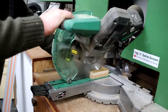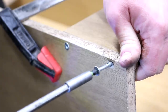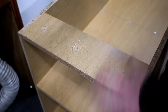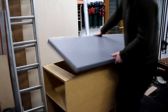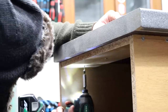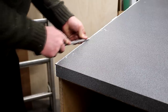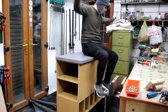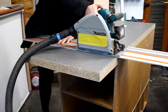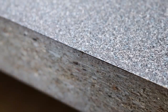The final panels were cut from some off cuts and added right at the top purely for fastening the worktop down to the unit, so I'm drilling some pilot holes. This piece of worktop I found recently in a skip and it was almost the perfect length — I just needed to scrape away some old silicone at the back. Then I did a quick jump test, marked up the worktop for length, and cut it using the track saw. I'm always surprised at just how cleanly this blade cuts — no chip out whatsoever.